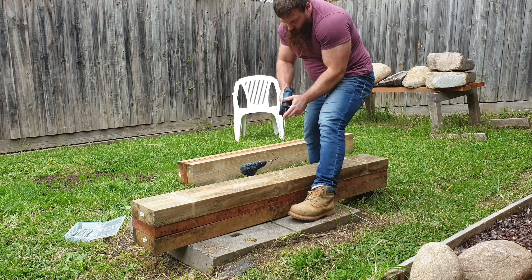The reason I left the screw sticking up on the dowel handle was that if I screwed all the way down with the 150mm screws, the screw tip would stick out and hit against the wood. Once I secured the plate in place, I drilled it in further and made sure it was nice and flush. This is what they look like all attached after a quick coat of paint — a very easy, very cost-effective build that works really well. Here they are in use. If you have any questions, feel free to comment below, hit like and subscribe, and have a great day!